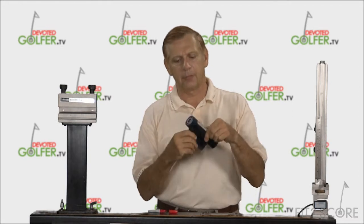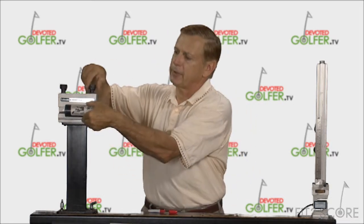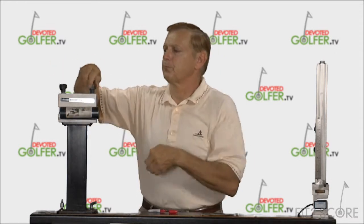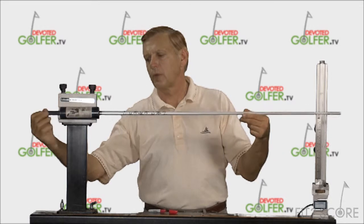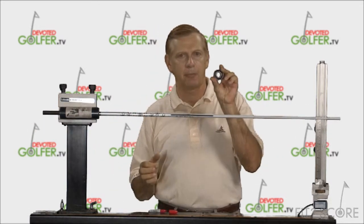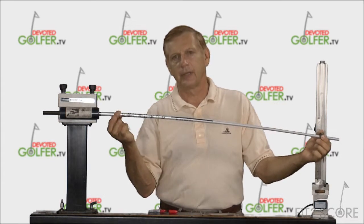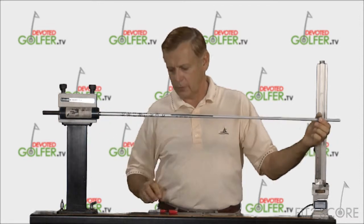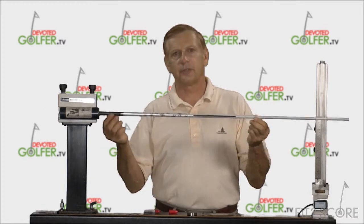This is a bearing-based spine finder. It's a tube of metal with a bearing pressed into each end, and a flange welded to the bottom so I can clamp it in a shop vise. Today I'm going to be clamping this into my deflection instrument. The shaft is then inserted through the two bearings so it's free-spinning. I'm going to take a third bearing and put that around the end of the shaft so it's still free-spinning, and you see this line on the shaft is going to snap to the same spot as I rotate this shaft under load. So what I do is take a Sharpie, draw a mark down the top of the shaft, and in a bearing-based spine finder, this mark indicates what is believed to be the spine of the shaft.